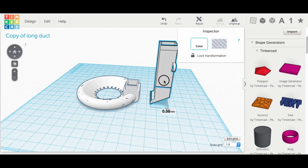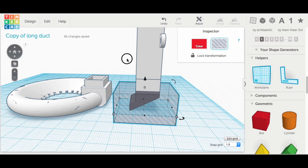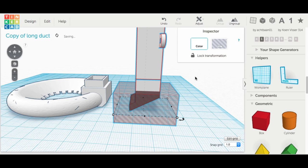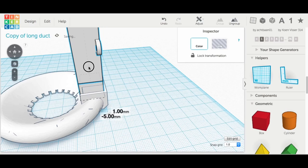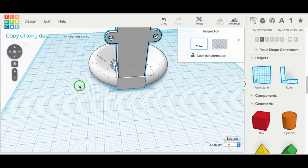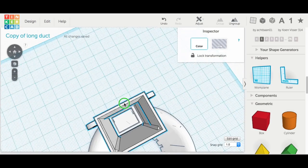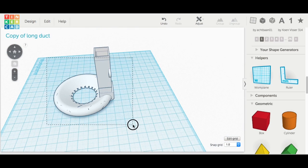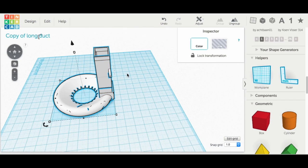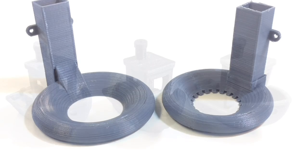I decided to experiment a little bit. I found this round duct on Thingiverse, brought it into Tinkercad, then brought in the duct that actually worked on the machine, chopped off the bottom, and lined these two up. It seemed like a perfect fit and when I looked down the chamber it was lined up like these two were designed to go together. So I grouped them together and printed it out on the machine, along with a second one I designed that was way off in dimensions. I installed the one on the right and tried it out.